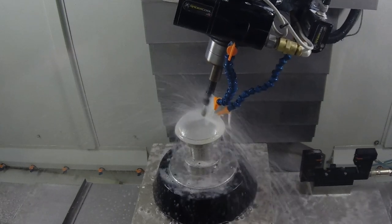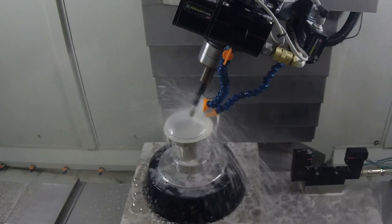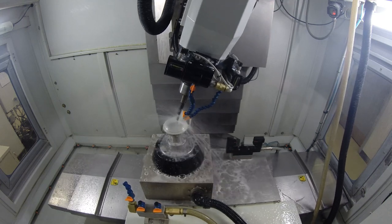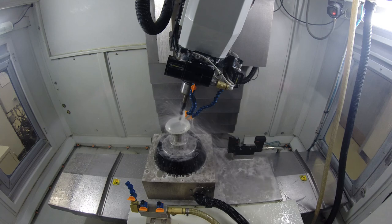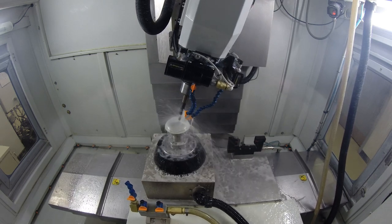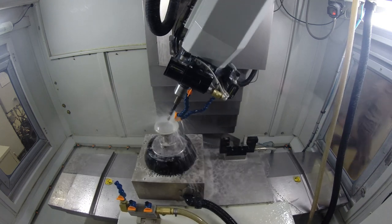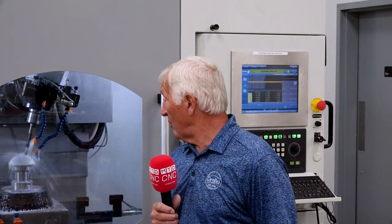Besides the ultrasonic technology — we call it Intellisonic — it's pretty amazing. We actually adapt the tool as it's in the grind. We're modifying the power being pushed into the tool so it stays on the resonant frequency, which is its power optimization parameter. This was all created under Navy research grants, NAVAIR specifically, and they were very supportive in our efforts. They were very important in our development of these technologies.